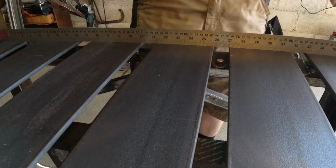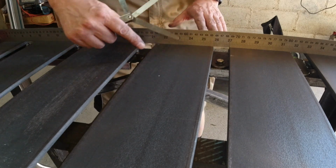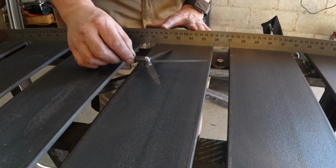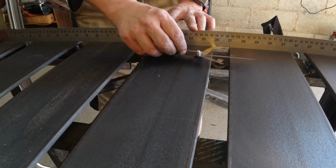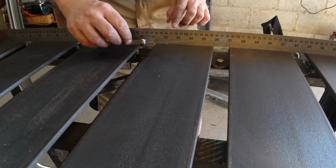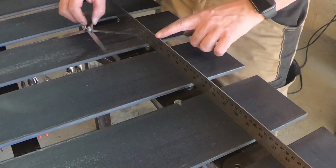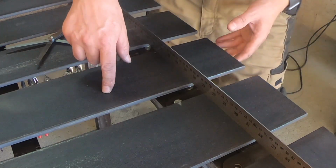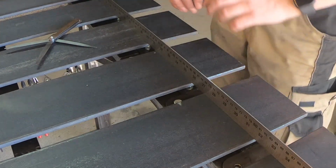So when you are measuring from different angles, it means that you might be measuring in the gully or the ridges or whatever the deformation of this is. So again, binds, completely binds. So it's very difficult to make sure that you're not chasing a flaw in the bars or a flaw in the adjustment. So that's why I'm going to sand it.